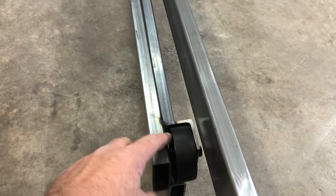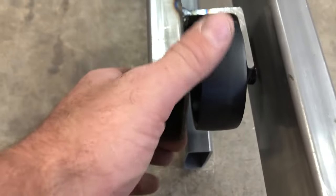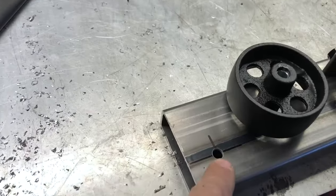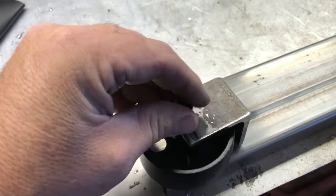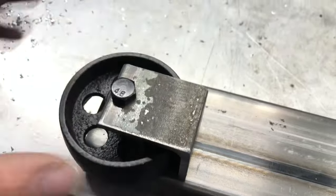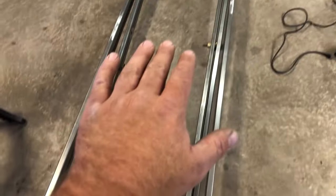I have the upper roller installed on the inside arm on the right-hand side. What that will do is put pressure on the back of the table to lift the back of the table. I've drilled a hole through this side and built an L bracket to support it — that will go through like that, tighten the nut on the inside, and then I'll weld this in like I did on the other one. We'll repeat that on the lowers to roll across the ground, and that will give us our rollers to make the table lift.